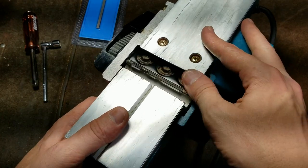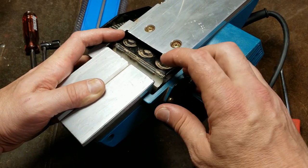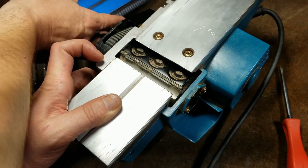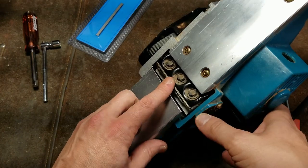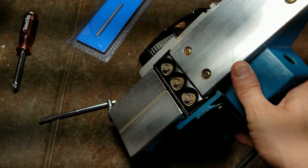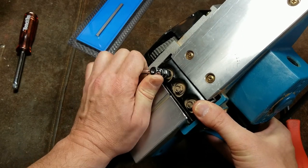How these work is they have three different bolts here. It sits on what is like a washer plate, which is then compressing a steel plate, which is actually holding little carbide inserts. So we'll see how beat up this is. Usually you can get them in there, and then we'll do a test to see if sometimes it's just so warped that the blades will crack when you're using the tool again. Always make sure that the tool is unplugged, obviously, when you're working on it. But many times you can recover. But this type of damage is pretty severe.